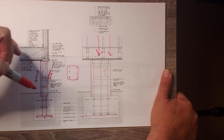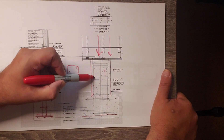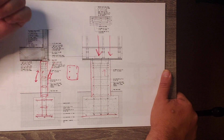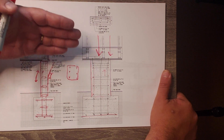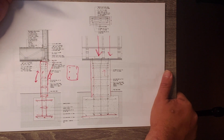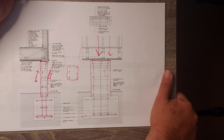On the long side, it's very similar — just expanded from 10 inches to 30 inches. We have the vertical bars and a whole series of horizontal bars, so we have that matrix — basically a steel cage — and then we cover it with concrete. The concrete handles the compressive strength and provides the durability and weatherization, while the steel handles all of the tensile forces inside. Taking that pier up, we then have to connect it to our wood floor framing system.